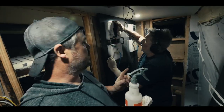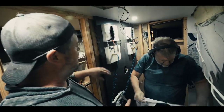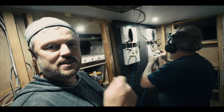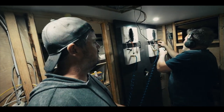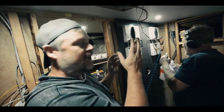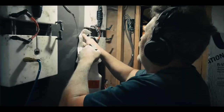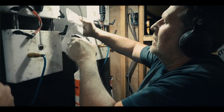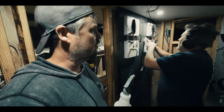What he's doing right now is seaming two pieces together. This device basically suctions to both pieces, he mixes up some epoxy that's colored the same color as the stone, and adjusts these knobs - it pulls them in or pushes them out depending on how you need it - making it very close to where you can't see the seam. Dave's been doing this for 15 years; he is an expert in stonework and craftsmanship.